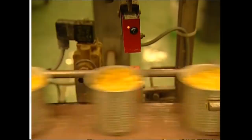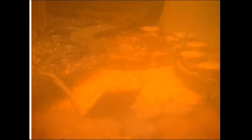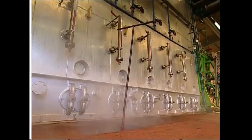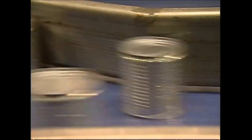The lids need to be put on the cans in a vacuum so that no air gets sealed in — that happens in a special chamber. There's one more step to ensure that the corn will last: the cans go into a machine that is like a giant boiling pot, and for six minutes they get heated from 25 to 130 degrees. This sterilizes the cans so it will keep the corn fresh for years. 20 minutes of gradual cooling later, and the best before date can be added.